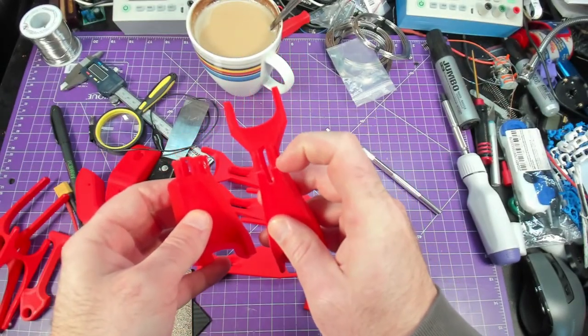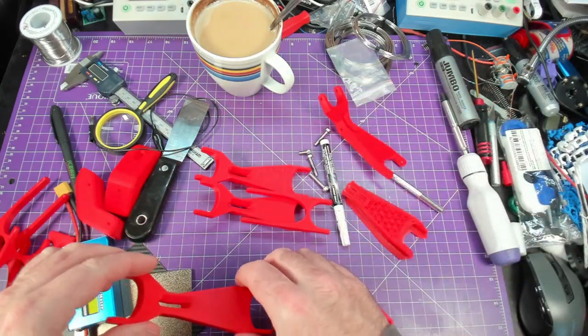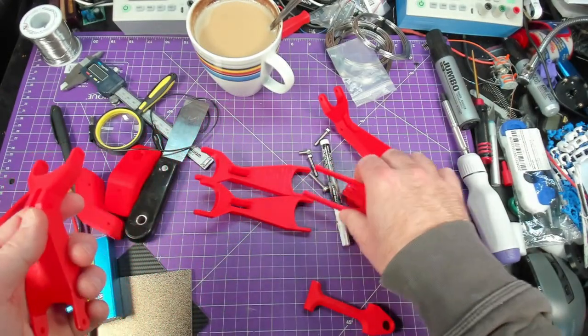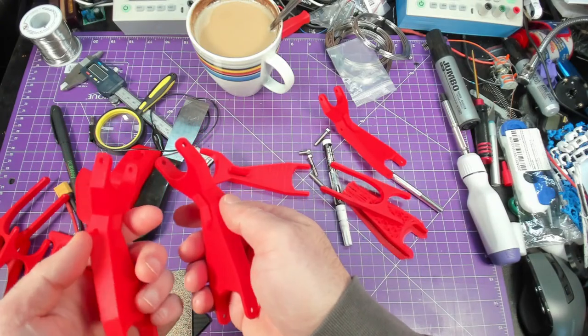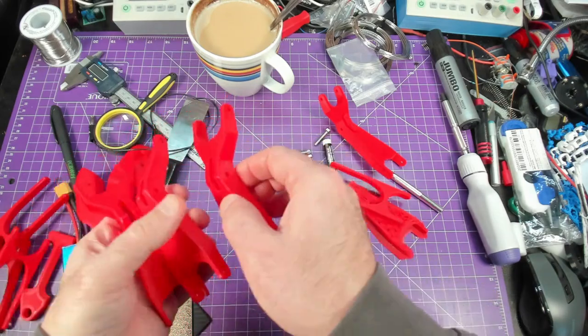However, it still wasn't enough, so I reoriented the print so that this points out of the machine with that fan, and now it looks great. The overhangs are nearly perfect. So the V0 is a little low on cooling. There are new tool heads that fix that, but I haven't made a video on the original machine yet.